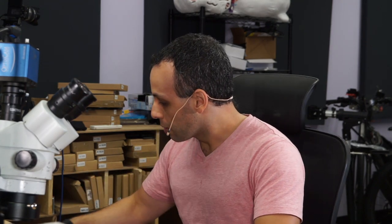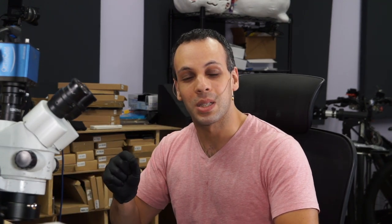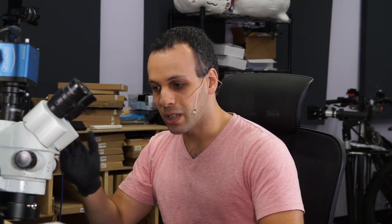Whereas the RAID 0 array, I have a RAID 0 array on this machine. It's three Micron SSDs I think I got on Black Friday. They were refurbished. They're 2 terabytes each. I got each of these SSDs at the time for about $150 or $160 on sale. There's three Micron 2 terabyte SSDs in RAID 0 right now, and I have been writing to those SSDs every single day for the past 2 years. And those SSDs are working just fine. I write to them. I'm like, X264, QP equals 8, preset equals very fast. These are large recordings, and they don't die.